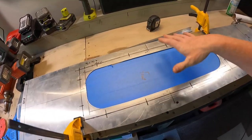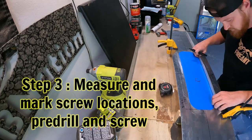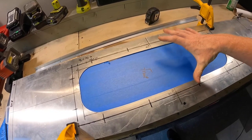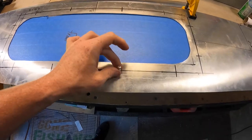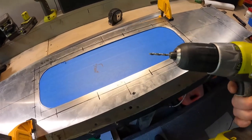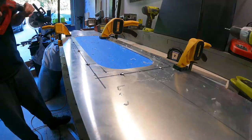This is the top and this is the bottom as far as when this is going to be fully installed. You can see I have these lines on the outside going around the perimeter, and I have my marking points where I want my screws to actually hold this acrylic against the back side of the aluminum. This is my first time messing with acrylic, and I have these self-tapping screws, but I'm going to pre-drill my holes first because that seems smarter than just putting self-tappers straight into acrylic.